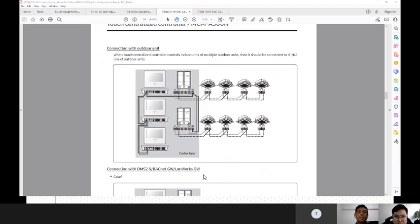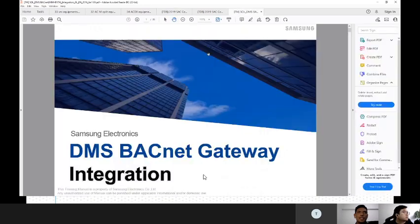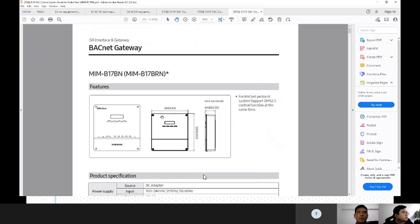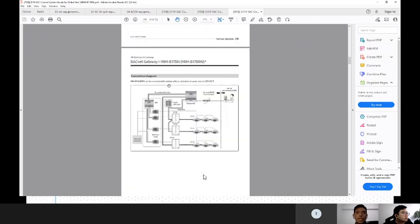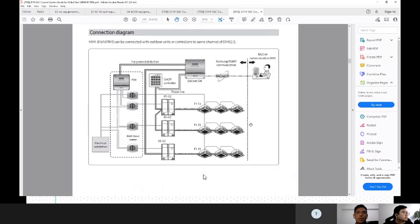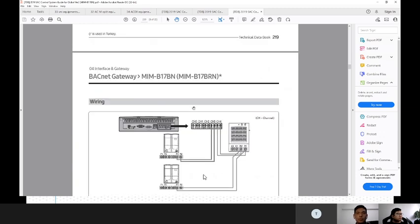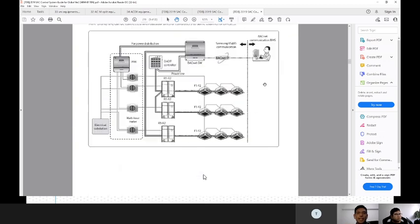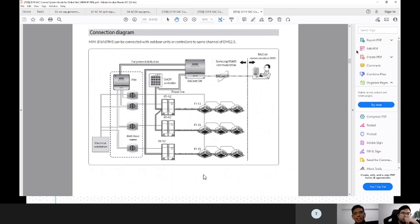So for example, you're in your office, and you have a BMS BACnet gateway. Because our interface is actually found on a website, like one of those router websites, with a web address like 102.222, you will be able to access the BMS via that web address. It's not a direct Wi-Fi access, but it's a small hack that you can do.